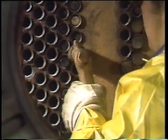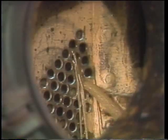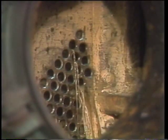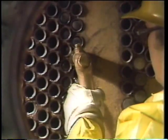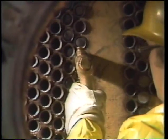It's really important to make sure no one is in the other water box, as the force of the brushes coming through could hurt someone badly. After he's done with one group of tubes, a helper collects the bullets from the water box at the other end. While the helper does this, the mechanic places another bunch of bullets into the next group of tubes and signals his helper when ready to shoot. Communications with everyone are critical so no one gets hurt. To shoot the tubes, he simply holds the nozzle of the water gun firmly in the mouth of each tube and pulls the trigger. He can feel the water pressure and can tell by feel when the bullet has gone through and out the other end.